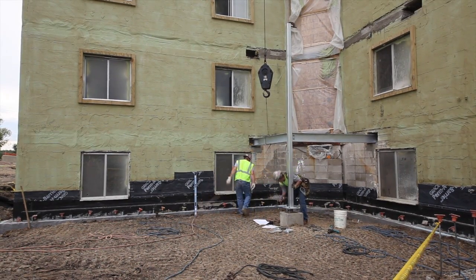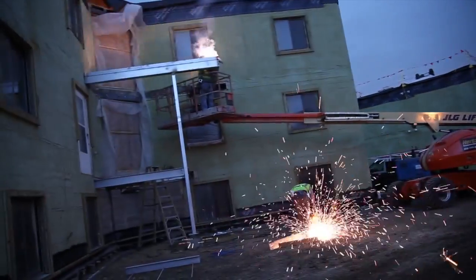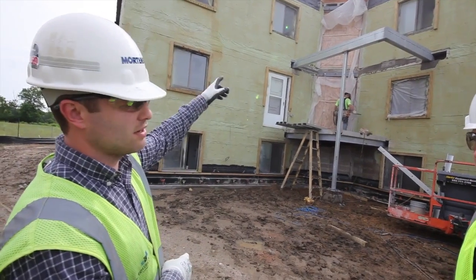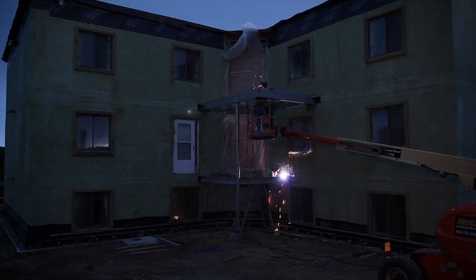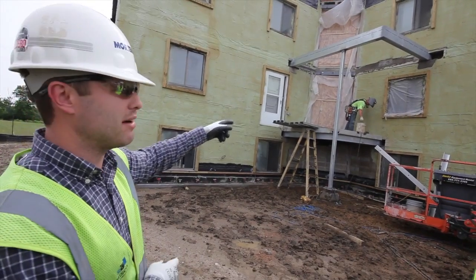If you have one primary entrance like Ben talked about for Richardson and one for Strohm, they're identical. Basically you can see the concrete foundation. They have a tube steel column that they erected first, and all the structural framing, the beams tied into that. And there's embeds into the existing backup wall that they welded those beams to support the structure. Right now they're hauling the decking over to the platforms.